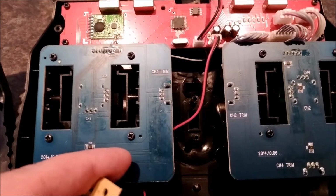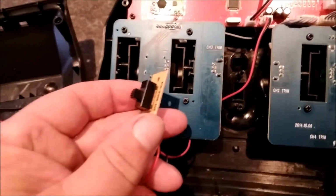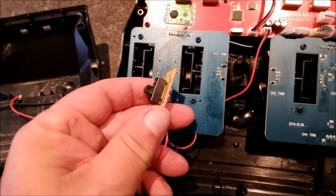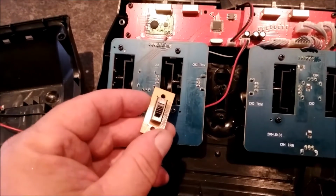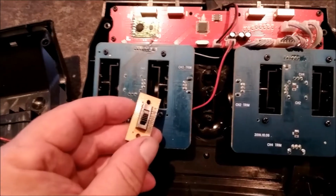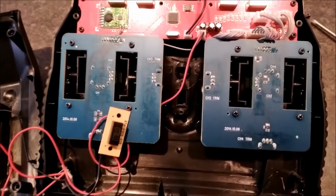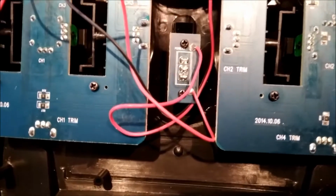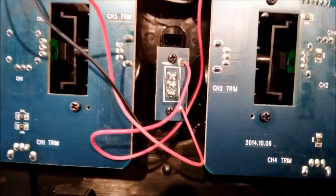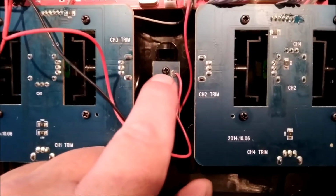On, off, on, off. And so the switch itself, which I initially thought might be the cause of the problem, is actually okay. So let's just pop this switch back into place, and we'll screw it all back together. I'll turn the remote control over, and you can see what I believe to be the actual cause of this problem. So there we are, the switch has now been screwed back into the casing, and you can see the 2 screws involved, one just here hiding under that wire and one there.